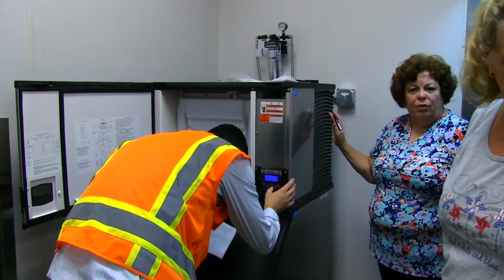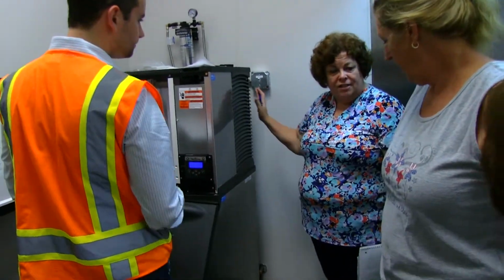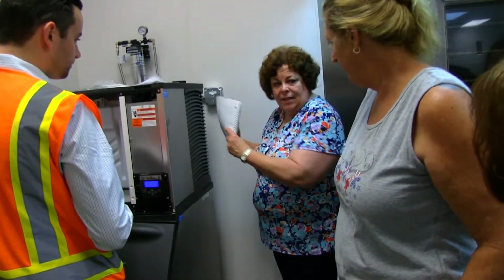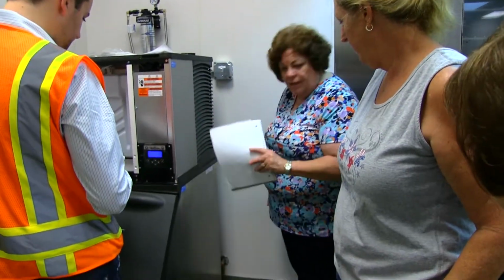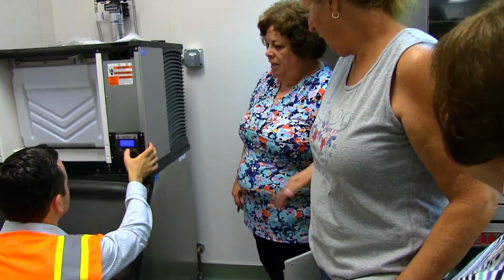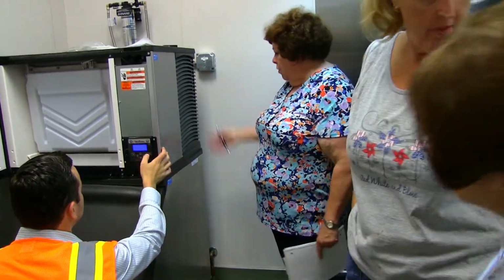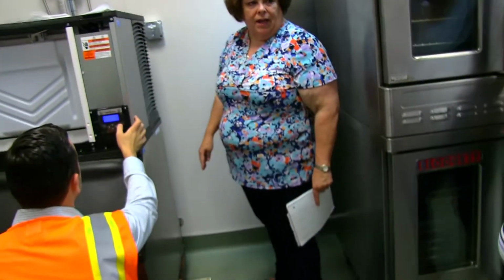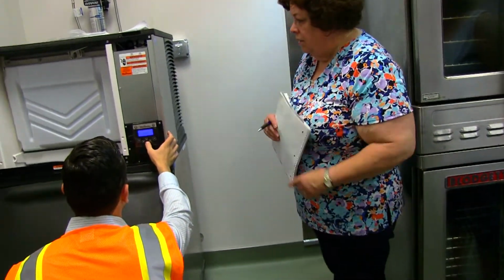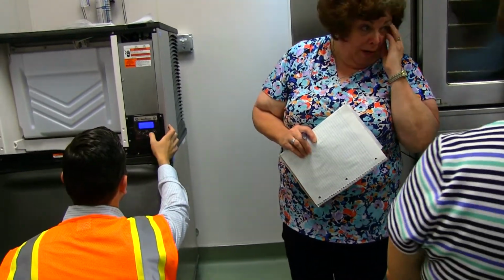It's really important, you guys, that we don't put anything in this space, because the exhaust from this will ruin your ice machine if you back the heat up into it. No matter what we want to use it for, unless it's low, we can put a low part in there. I don't know yet, let's wait. It's blowing it down, as long as it doesn't bounce back up. But that ventilation on ice machines is crucial to their health.